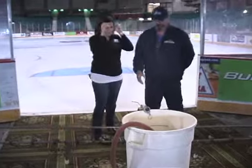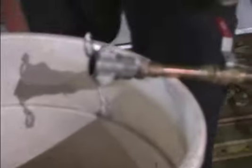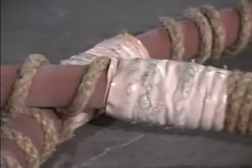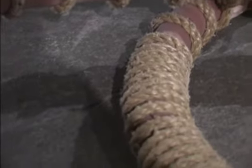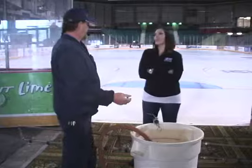Well, basically this is what we call a spray wand. We hook it up — as you can see, it's like a garden hose if you want to call it that. The guys are taking a break right now; they're thankful I'm here so they can rest before they spend two hours on the ice. They're actually going to be holding the hoses as we go along, because if you don't hold the hose, as hot as this water is coming out, it will melt right to the concrete. That's the reason you see the rope attached — it helps cut down on labor. Those guys have to keep that hose moving at all times out there, otherwise it will melt very quickly to the floor.